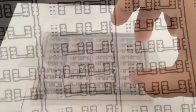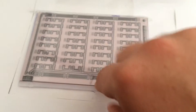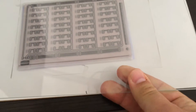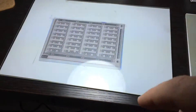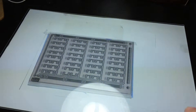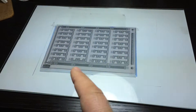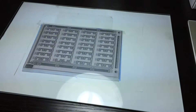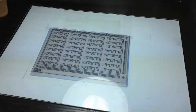I'll set up the lamp. Just bring the glass, and when the glass sits on it, it will make it nice and flat. The lamp is turned on and I just started it. I made it far from the board so that the exposure is even all over. This way it takes about 18 minutes. I'll try to give it 20 minutes. It's getting darker already.